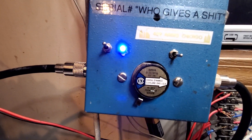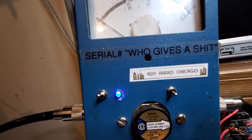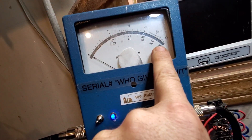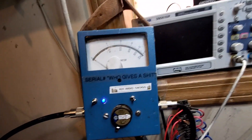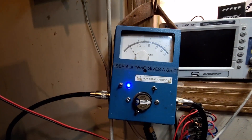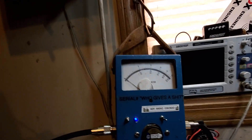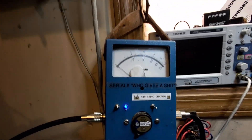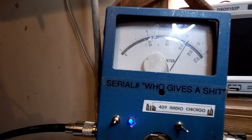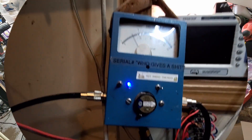We had to remove a tuner — the single tuner in a Firebird is a 30-60 pF common air variable, you'll see it in every 6LQ6 box, seven turns and on the sixth turn you're done. Here's our power — we have a 100-watt slug and we're on the 500-watt scale with a pre-scaler. We'll turn our carrier all the way down. The amp is on with a nice 10-15 watt carrier. Let's give it some audio... 350-375 watts right out of the tubes.